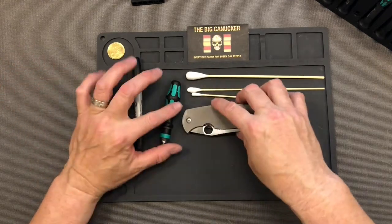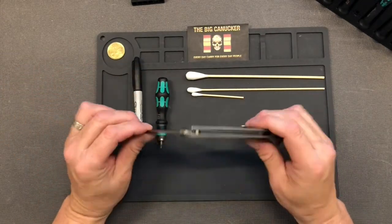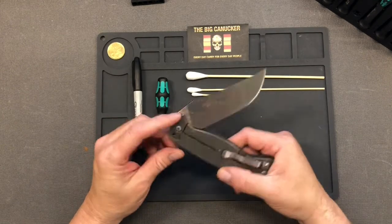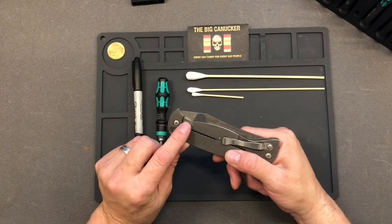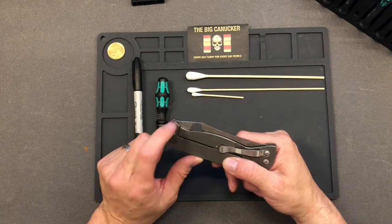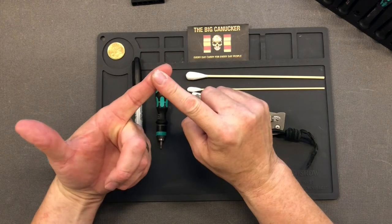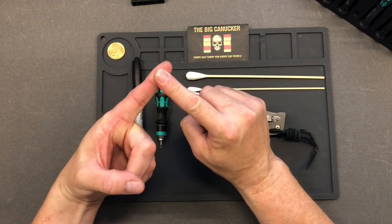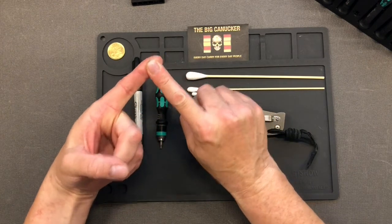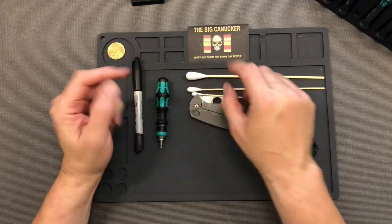Now, for any of you who are not familiar with what lock stick is, you've got two separate types of material mating, and they're galling. So you've got a hardened steel face, and you've got a titanium face. Now, titanium is normally a softer metal than the steel it's mating with, and so when they hit together, a tiny piece of titanium, as far as I understand, softens and almost galls a little bit, and it kind of locks into place there, and then it really puts the pressure on to snap it free. That seems to be it.